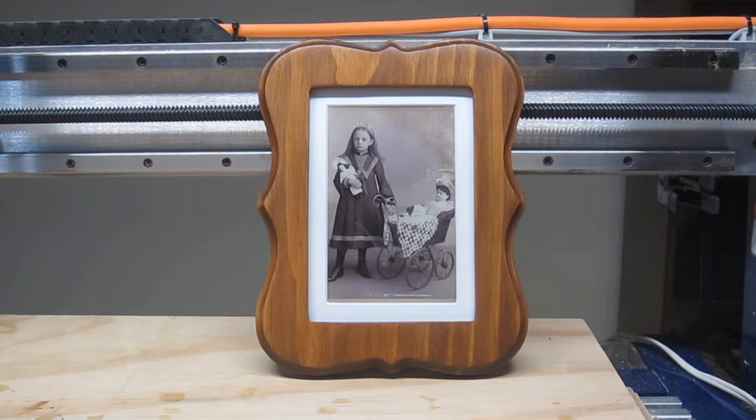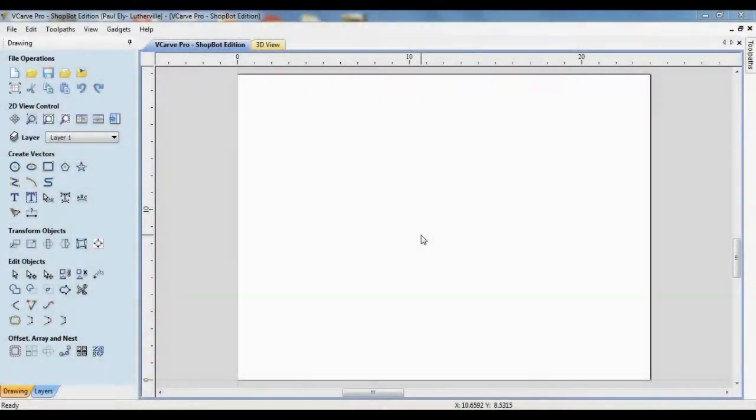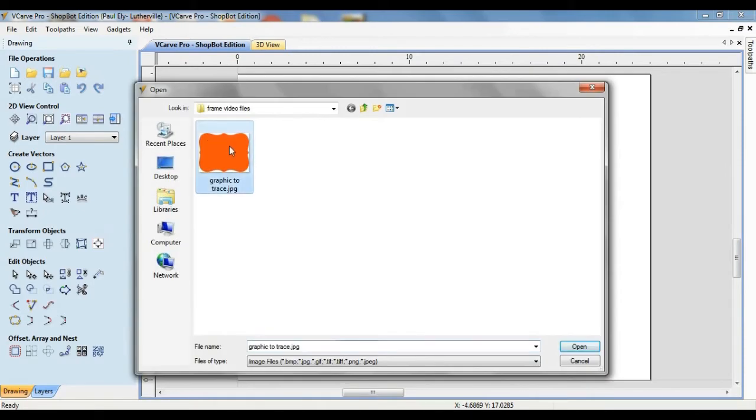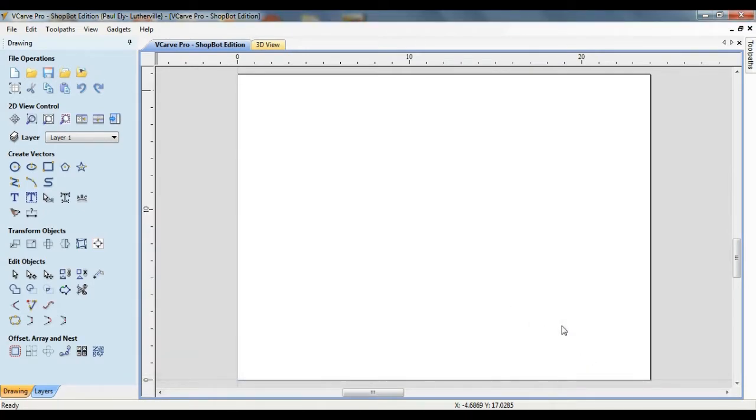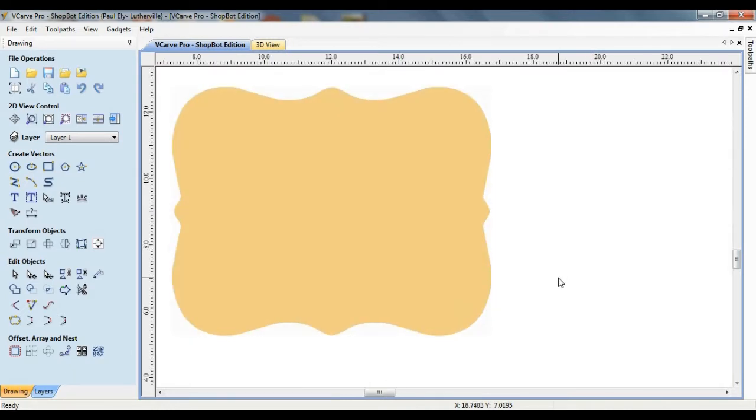This project was cut from a 13-inch long piece of 1x12 radiata pine. The general shape of this frame was based upon an image file. I've made a recreation in order to demonstrate the drawing approach. When tracing what's supposed to be a symmetrical object, I've found it's not really necessary to draw the entire piece, partly because the reference photo is oftentimes slightly distorted, which would result in a vector that's also slightly distorted. The approach I usually take involves drawing one quarter of the design, and then using the mirror and join open vector functions to complete the remainder.